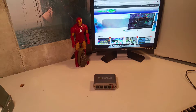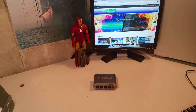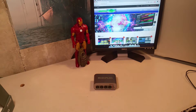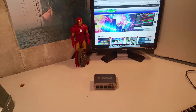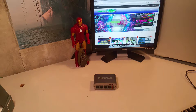So how are we going to hook it up? I've got some toys we could use. First thing we need is a USB. Now keep in mind, when you use a USB like this, since it's going to so many devices, you want to make sure this USB goes straight into the computer — not onto a USB bus or USB adapter. You want it directly connected, because going through a bus can mess up your MIDI transfer data. Also, a lot of times USB hubs are not powered and you won't get enough power and you won't see anything. So make sure it goes straight into the computer.